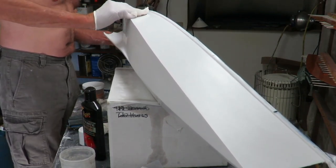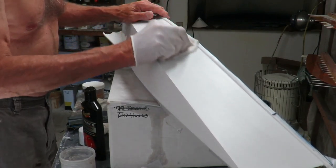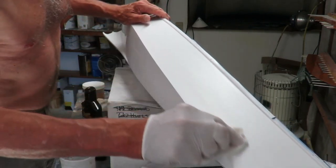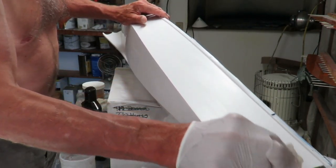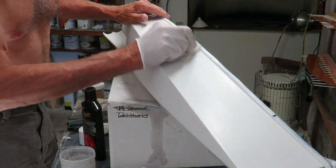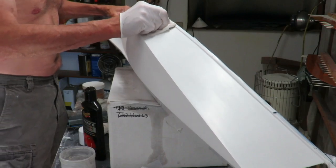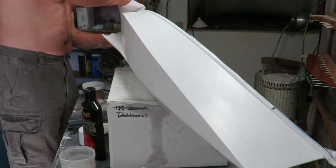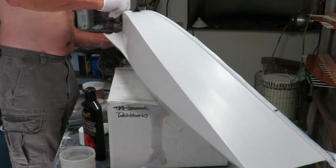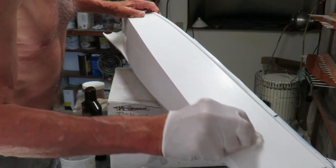But it's a real pleasure. It's fun. One comment though, the reason some boats are matte finish or satin finish is if there are any imperfections in the hull, if you go to a gloss, all those imperfections become really obvious because the light is reflecting off the hull in distorted ways if there's any imperfection. So if you're not sure your hull is quite perfect, not to worry, but you might not want to go to the high gloss finish.